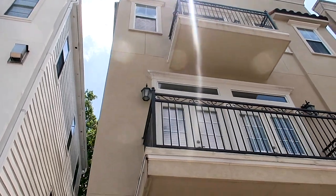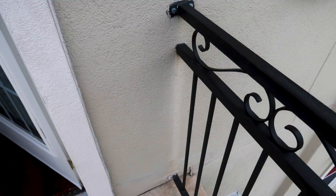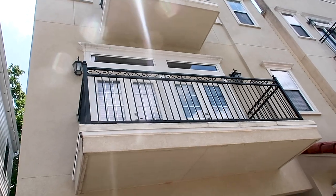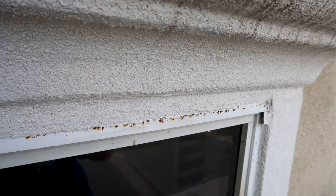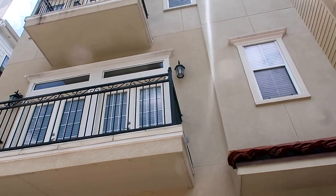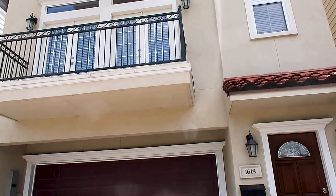From the ground outside, they poorly installed a lot of bolts around the stucco, and you can see the water lines — just follow the water lines. In this area they had no substrate anymore. The water lines are coming through, and you can see rust stains on the overhead flashing because the caulking on top of the EPS bands is missing, so water is running down behind these bands and rusting out the overhead header flashing. I recommend repairing both areas around the decks and removing and replacing the lower flashing around the decks entirely.